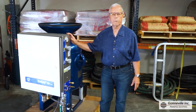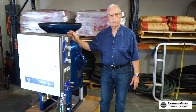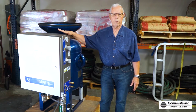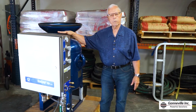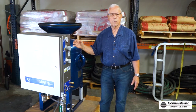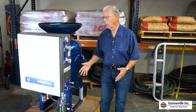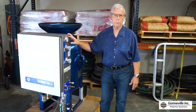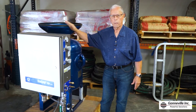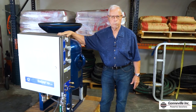This is Graco's EcoQuip EQC. This is the unit that formed the basis for the EcoQuip 400T trailer mounted unit that's no longer being manufactured by Graco, as well as the unit that is mounted within a crash frame designated EQS. It consists of a six and a half cubic foot blast pot and the unique EcoQuip control unit.